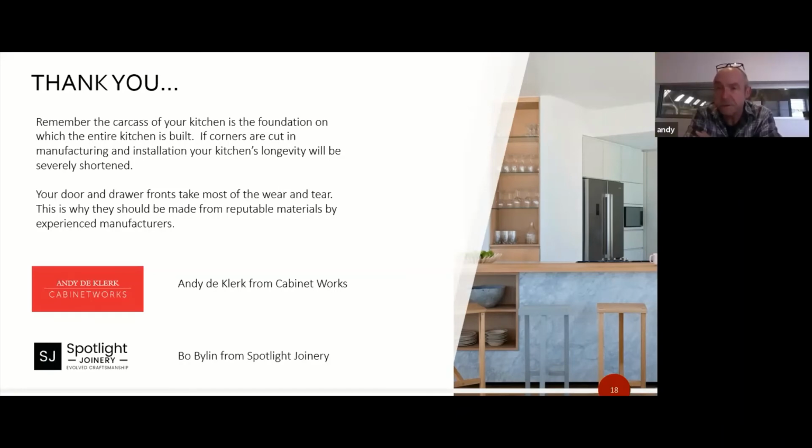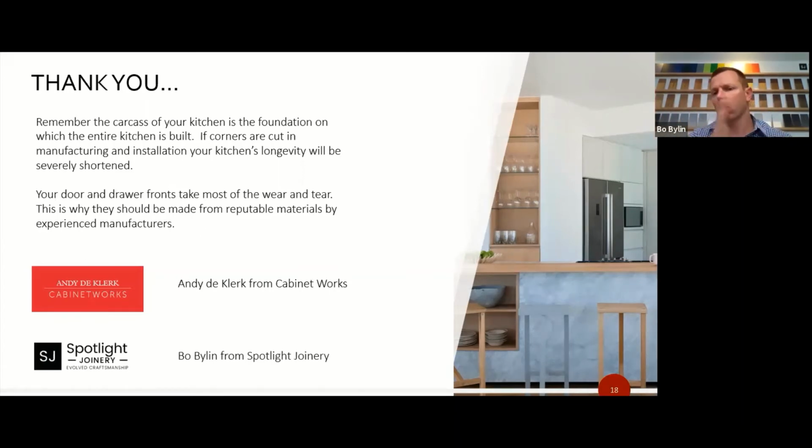most cost effective. Yeah. Karen, Andy's talking more high end here, and yes, that is an ideal situation. The majority of clients can only afford a white melamine carcass. I think what's really important is that the joiner or fabricator is building modular carcasses so that should anything happen with the water itself, it's potentially contained to that particular unit, and only that unit is then replaced, rather than all the water flowing out onto the floor.